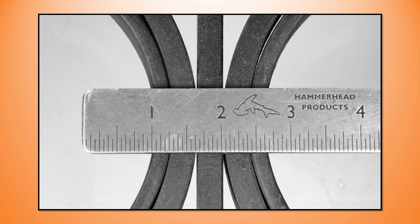So back to the first point, which is measurement. At some stage, you're going to have to cut the collar from the collar material, so you need to know where to cut. There are multiple formulas out there to help you determine the length of collar material needed per type of collar used, whether you're doing the wrap, the forged, assembled, whatever it is. And all of the formulas are correct, but they don't transfer from one method to another. So it's pick your poison and stay with it. I would encourage you to do some test pieces before you attempt to wrap anything around your hard-worked-for grill, just so there's no gnashing of teeth later on.